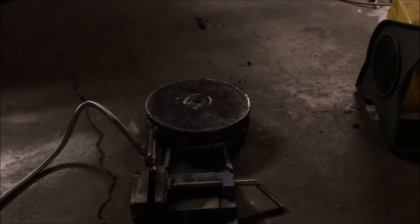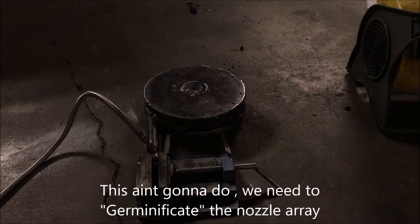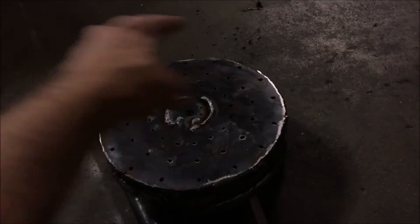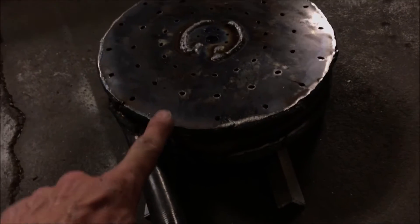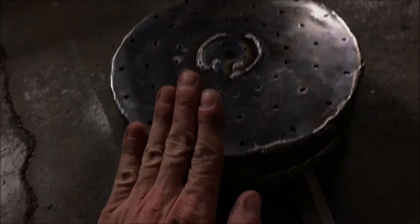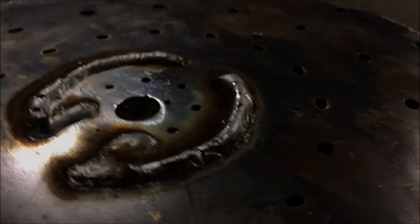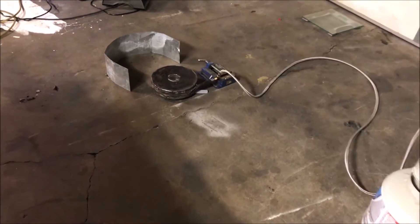The spud is very small — maybe that's inducing the high velocities more so than the small apertures. These outer holes are right on the rim of the vortex, so they may be problematic; they could be shooting fuel in. They're aimed at a 45-degree angle inwards. Everything else is in a spiral, except for the center area — the center has an old rocket engine design with a concave spud and jets aiming at itself. We're now at a two millimeter orifice on the spud, and I am terrified of this thing.